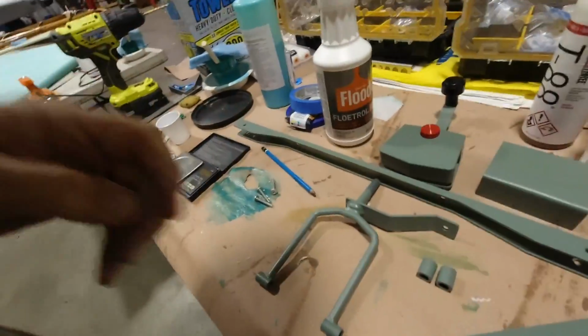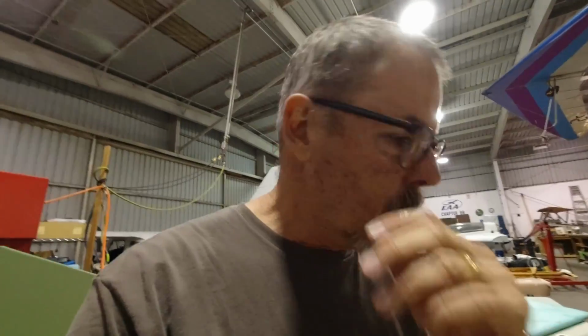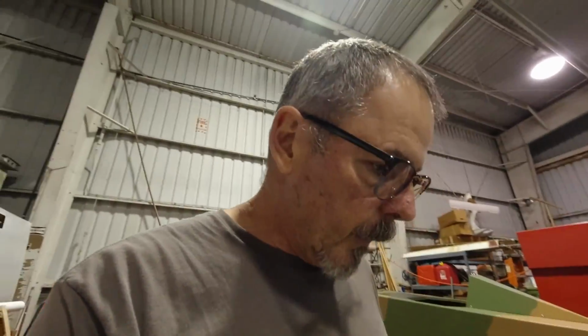I was gonna use a castle nut for this and then drill the shank, but I've decided not to. I'm using a different nut that I need to pick up, and my understanding from the team is that you pack this with high temperature grease, and then you put the washer and nuts on there, and a little torque seal. So it's a real easy thing to see and take a look at when you're doing your pre-flight.